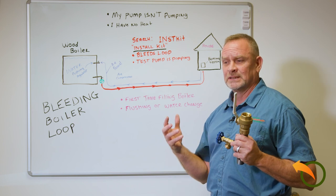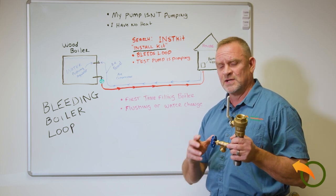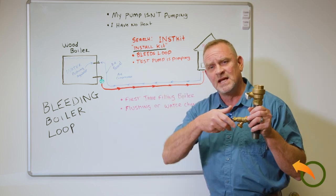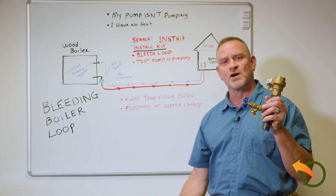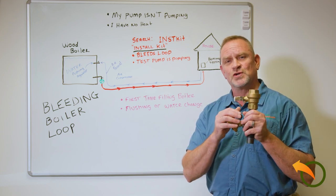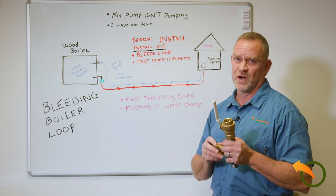— there's no way for you to determine if that pump is actually circulating water. Simple solution: shut your ball valve on the return side and open it. If the water comes out very, very slowly, you know that pump isn't working. If it comes out like a garden hose, you know that pump's working. So this is also good to troubleshoot pump issues.